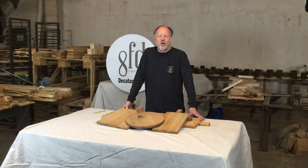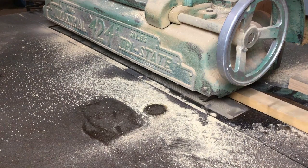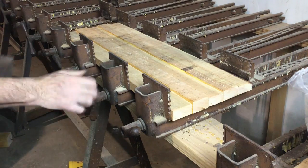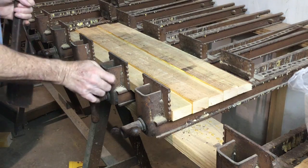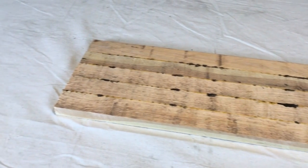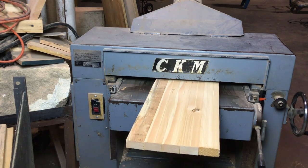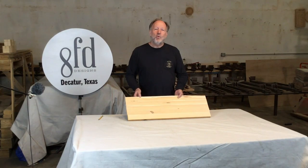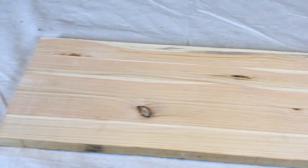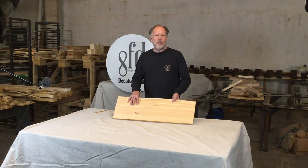The basic process of making farmhouse planks is like many of our other projects. It goes chop saw, straight line rip saw, glue rack. Coming out of the glue rack, our rough blanks have quite a bit of glue on them and unevenness, so unfortunately we have to take them to the planer. Once they go through the planer, they have a nice smooth surface which isn't at all what we want. So the next thing we do is mark the shape we want on our board, go back to the straight line rip saw, and then to the band saw.